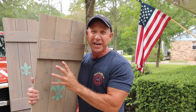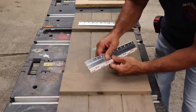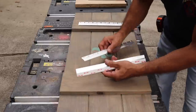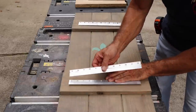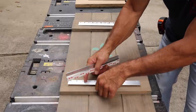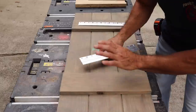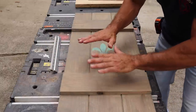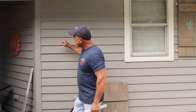Now what I'm going to show you on this video is how to make these quick-connect mounts. We're going to use French cleats — these things marry each other and snug tightly to the wall. We have a special tape that's real strong; we'll put one side on the house, one side on your shutter, then pull it back out and have all our holes here for fastening. Super easy — it's going to pop together in seconds and you'll have a shutter without even having to measure.